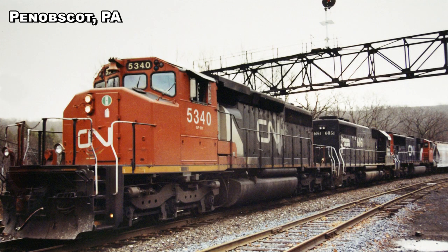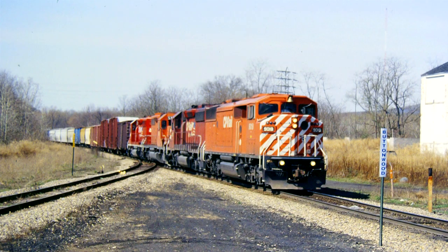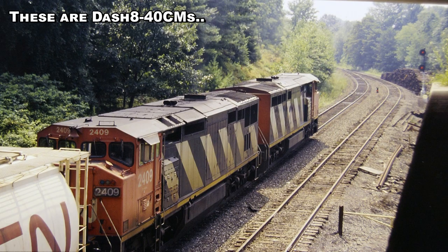Wide-nose units that were built for Canadian National were otherwise similar to other SD40-2s, but the full cowl body SD40-2F built for Canadian Pacific was in fact closely derived from the SD50F built for the Canadian National, and its car body and general construction had little in common with other SD40-2s.